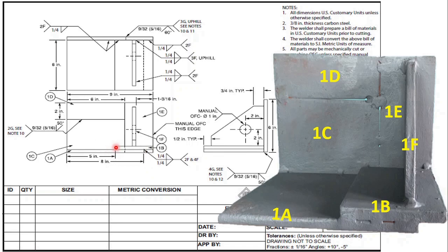If it is below, that is the arrow side. The arrow side shows 2f — horizontal fillet — and quarter inch is the weld size. The other side shows 4f, meaning overhead position welding. So here you will have to weld in 2f, that is horizontal fillet, and here you will have to weld in 4f, that is overhead fillet.